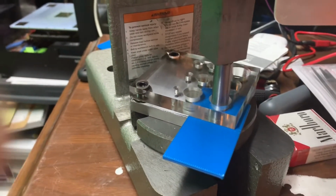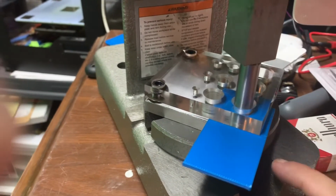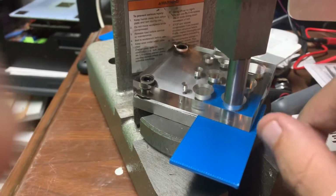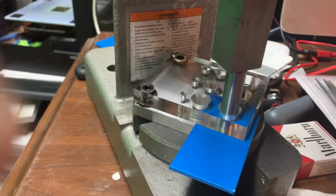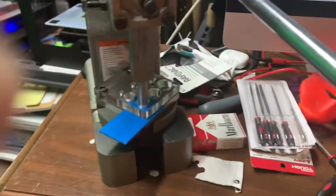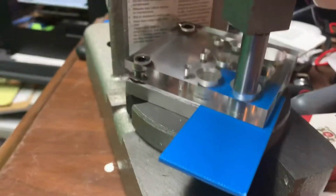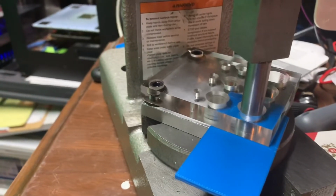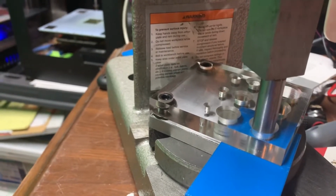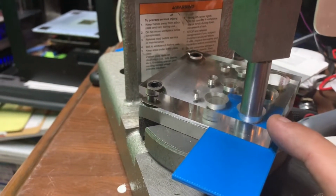So as a newbie to making rings out of coins, I've been trying to start this hole punch with this 1-ton arbor press. And it's just really difficult, especially since it's not mounted to anything. Eventually I wanna make this a bit longer so I can have more leverage. But I did discover if you just get an old-fashioned hammer, set it on some concrete and pound on it maybe 8 times pretty decently, you can get that plug out of there.